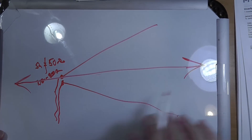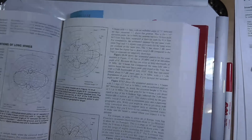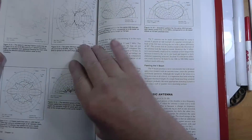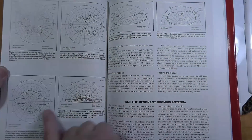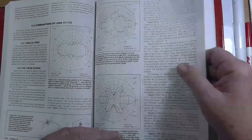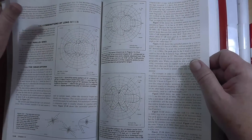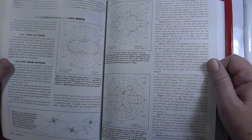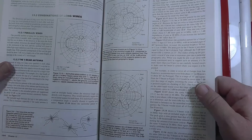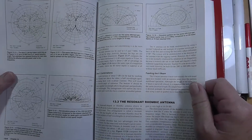This has a very sharp beam width. You can do that with this, and the antenna book talks about how to do that, including different types of elevation patterns you can get out of this antenna. To do a V beam properly, you need lots of space. Some people like to put these way high in the air, but you don't necessarily need to — because if you're working on 10 meters with one of these things, there are already multiple wavelengths in the air.